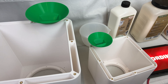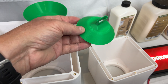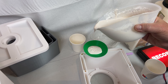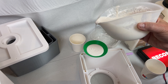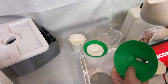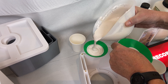I decided to design and print these green funnels, which should in theory make it easier not to spill everywhere. It sort of worked, but wasn't really necessary. In addition to filling Jesmonite in the pockets of the box, I also wanted to fill the back plate around the opening for the connectors. Pouring Jesmonite from the silicone bowl worked quite well — I could direct it into the openings without any problems, though it took a long time to flow through the funnel.